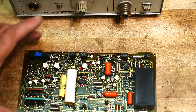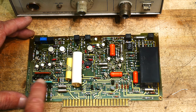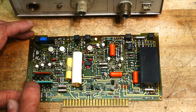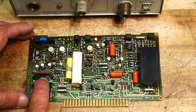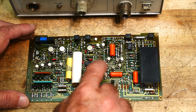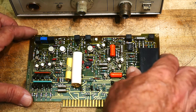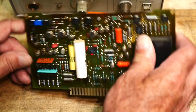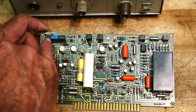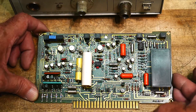The other card is the measurement card. This one has what looks like some FET switching here. And this might be the range — there are some resistive dividers here, might be range selection. It looks like this might be the input amplifier, with guard traces around these components. This is probably the 200 hertz chopper. There are some potentiometers on this: one marked linearity, one marked full scale, and one marked zero — so linear slope, offset, and some other things.